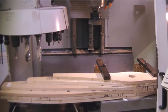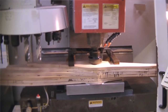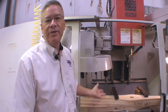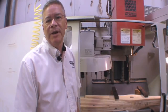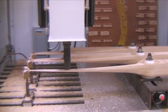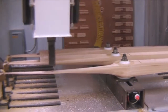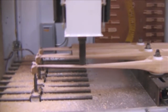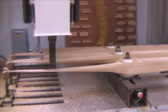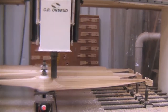Once it leaves this machine, the entire hub will be complete with all the bolt holes, center bore, and chamfers. The process takes about five to ten minutes depending on the size of the center bore and the number of holes in the propeller. After the propeller hubs are milled, all the propellers are mounted onto our CNC router where we profile the blade shape — this can be done one at a time or up to five propellers at a time.